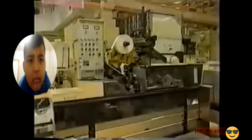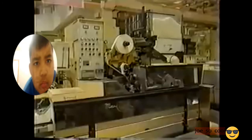Once the final flavorings are added to the tobacco, it is put in short-term storage. The total blend is then fed into cigarette-making machines, where it is rolled in paper and a long, continuous cigarette rod is created. It is then cut to a specific length, depending on the brand, and delivered to the tipping machine where the filter is applied. The finished cigarettes are then packaged, sealed, and ready for shipment. And that's how cigarettes are made.